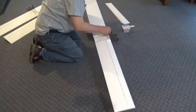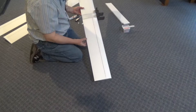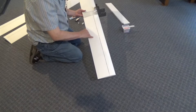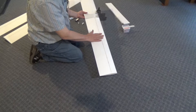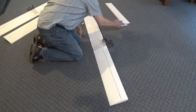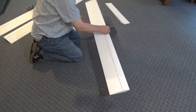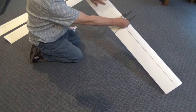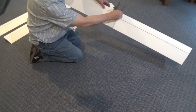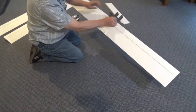So if you look at the foam, it's expanded polystyrene. It's got lots of little pockets and that's going to eat up a lot of epoxy resin if I put that on there just like it is. So I got some lightweight spackle and started putting that on here, just to fill in the holes and also fill in the little pockets. Then just with a light sanding it's ready for fiberglass.